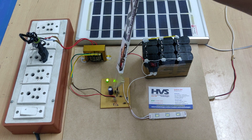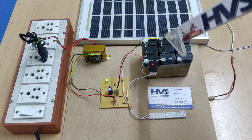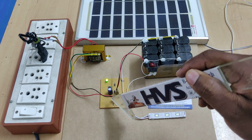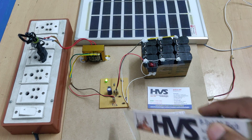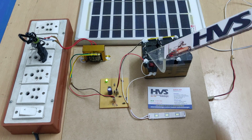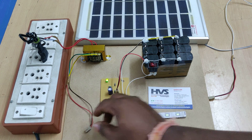In parallel we can see 2 diodes. The purpose of these 2 diodes is that whenever the battery is fully charged, it will be at a higher potential than the transformer. These 2 diodes will stop the current flow from the battery back to the transformer. The same applies when the solar panel is connected.